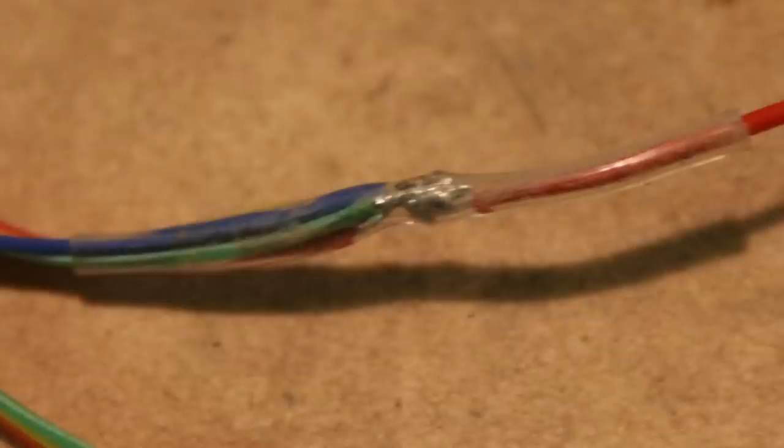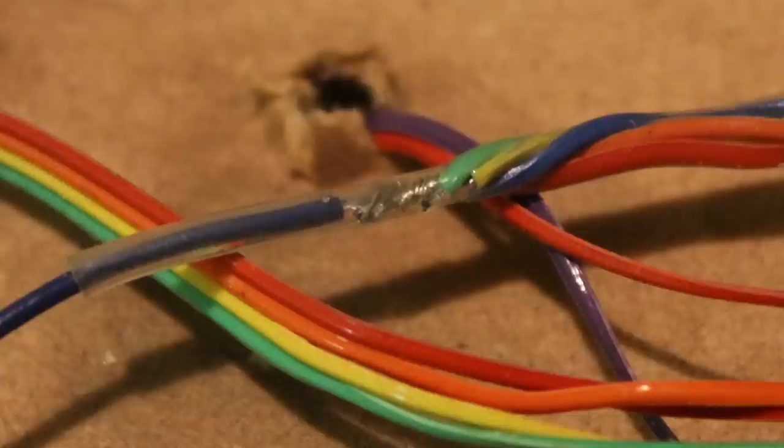You're going to take your long end of your data cable and strip and solder a significant amount of ribbon wire to it — just enough length to go from the back of your pedal board to the individual pedals. Remember, there are going to be at least two commons in your board. The easiest thing to do with those commons is to strip around 10mm of exposed wire, and do this for four other wires or however many need to connect to that particular common. Then twist all the metal together, add solder over the top, and heat shrink it so those wires can go off to the individual pedals.